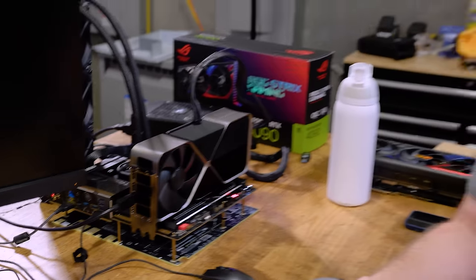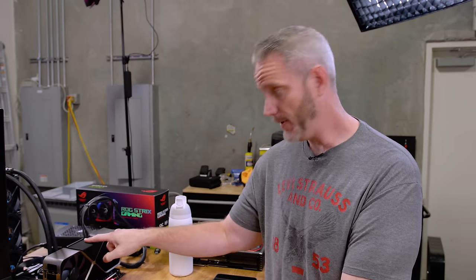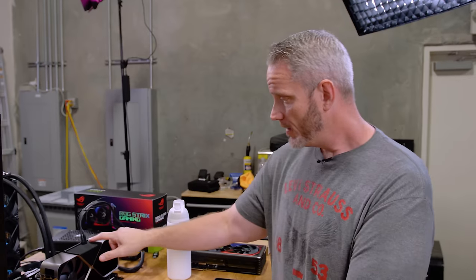What's happening right now is the card itself is not getting enough startup initialization power. This means lower end cards — probably 4070s, 4060s and such — will be fine with that. This kind of makes Nvidia right. If I took out both pins, would it have started? No. Taking out one pin and putting it into the 300 spec — not starting either. It's kind of funny because essentially the card is being lied to by unhooking that pin, because the power is there. All the main cables are occupied, it's getting the full 600 watts. It's just the sideband telling the controller on board: hey, we only have 300 watts. And then the card says well then you don't get video. But that's cool because it means it's not just brute forcing power through it.